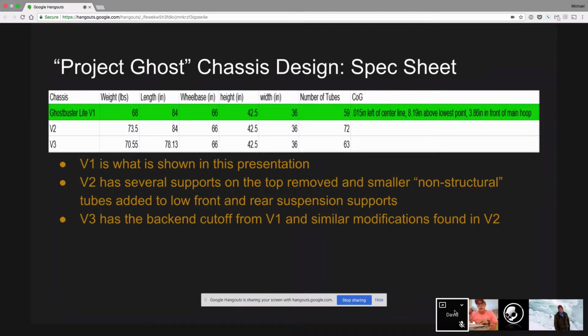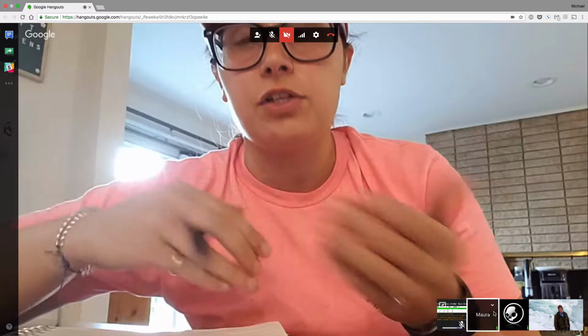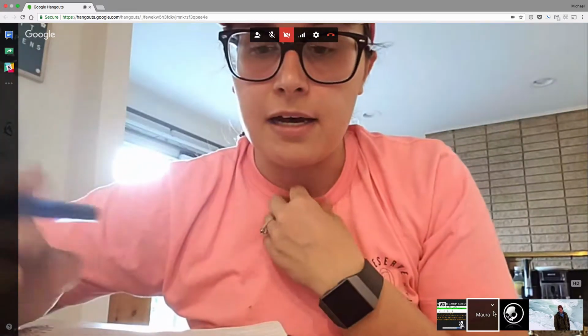That makes sense. One thing I learned is I did mine out of chromoly, so what you said about the difficulty of the welding is totally true. But even if you have to buy the square tubing for critical mounting bars, it makes a huge difference. It also increases the torsional rigidity, which you said you wanted. So it might benefit you if you can buy it.